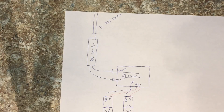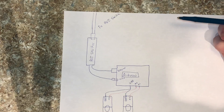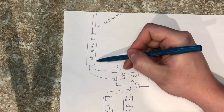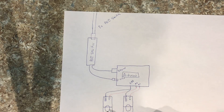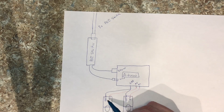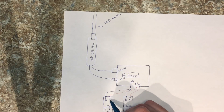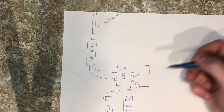Let's talk a little bit about how this is hooked up. Here's a little diagram I drew up — I know it's pretty awful, but it should get the idea across. We've got our feed coming in from our PoE switch. That goes into the PoE splitter, which then splits off to 12 volts and Ethernet, which plug directly into the Arduino. We've got our two CT clamps, and the wiring is very simple. Each one is labeled ground and 5 volt. We just join the two grounds together and ground to one of the ground pins on the Arduino. Then we hook up the 5 volt line to each of the analog pins — analog 0 and 1 in my case.